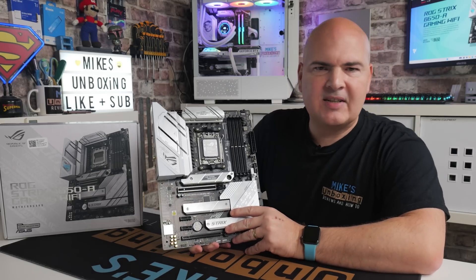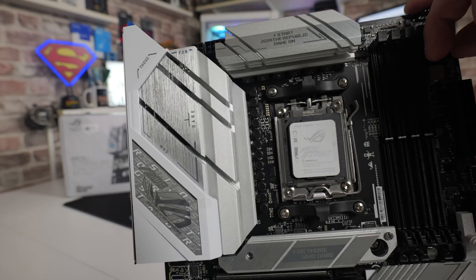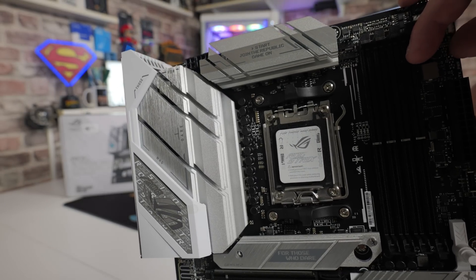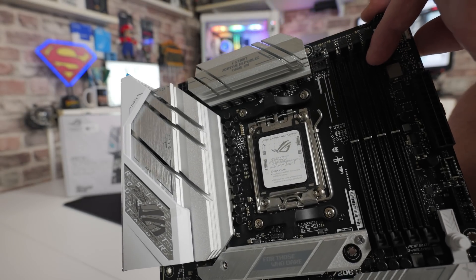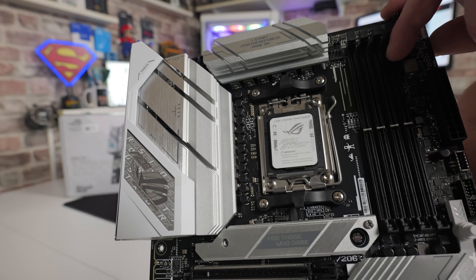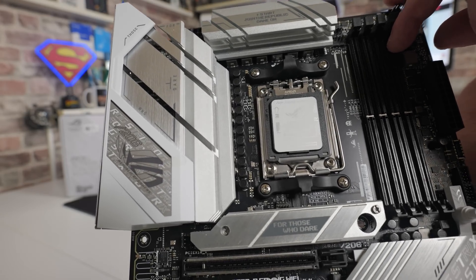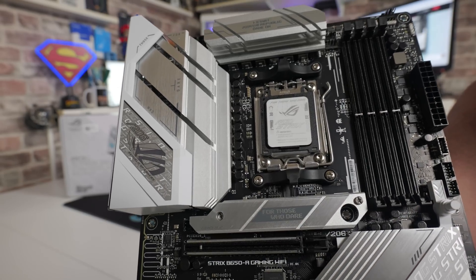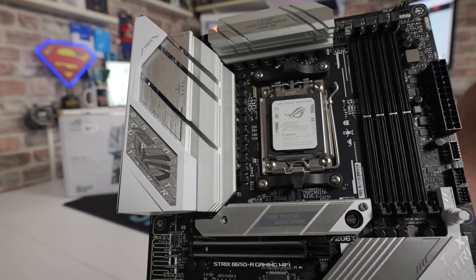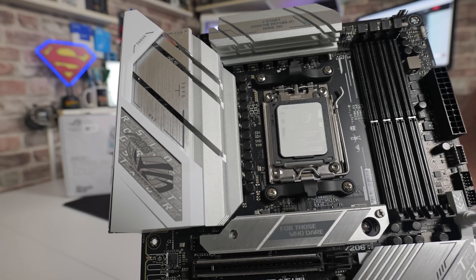So that's pretty much it for the unboxing. Let's take a look at the motherboard and see what it offers. In terms of VRM, you've got a 12+2+1 setup with 60 amp chokes, so you should be pretty good for most processors. Obviously, if you're looking at putting in a 9950X or 9950X3D and want to be doing day-long rendering tasks, then possibly the VRM might get a little bit toasty — although there is a massive heatsink over this, and it's actually quite a weighty board.